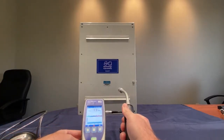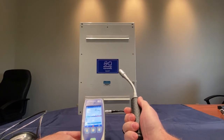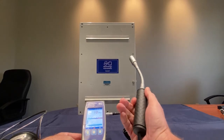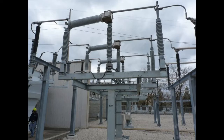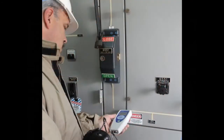To begin testing, you put your headphones on. You hold the instrument in one hand, and in this case the wand probe in the other hand, and you pass the probe around any door seams, gaps, bolt holes, vents, louvers, etc. — basically any place sound can come out of. You can do this at a fairly decent pace, and you're going to be listening for a change in sound. This is an example of what surface partial discharge sounds like. This is an example of what corona discharge sounds like. Here is another example of surface discharge. And here is an example of noise.